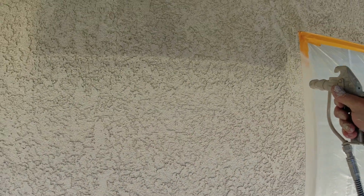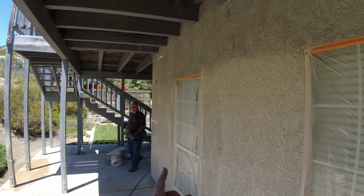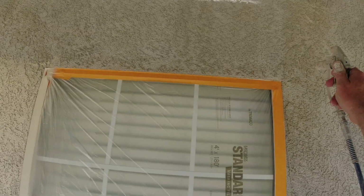You should be replacing your tip every 100 to 200 gallons, somewhere in there. If you're not doing that, then you're going to waste a lot more material. A lot of guys are using reversa tips, and they say, oh, these are the future, these are better. You get plug ups with those, and I can just reverse it and clean it out. All I usually have to do is tap it on the concrete, and it blows whatever's in there out. I usually don't have to take my tip off. I might have to once a day take the tip off, turn it over, put it back on the rig, and spray a little bit of paint through it. Once. So how much time is that? And how much money are you spending on tips at $30 a piece?